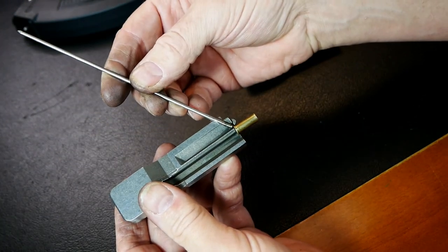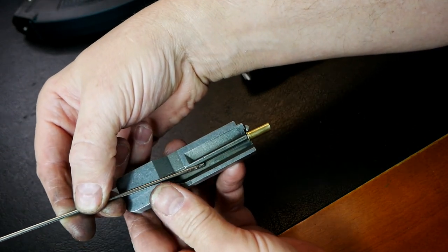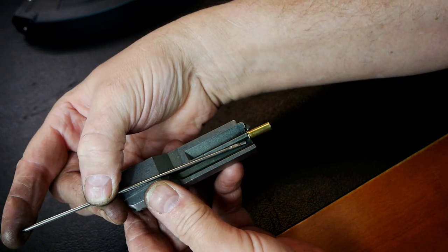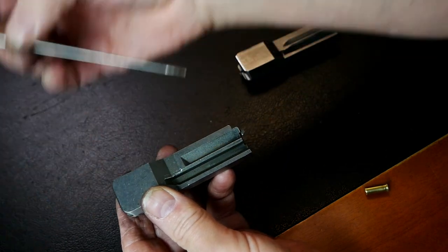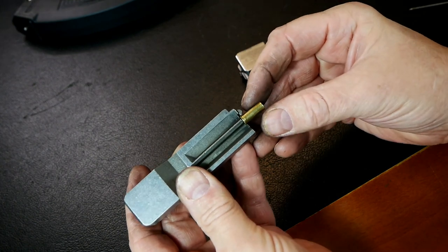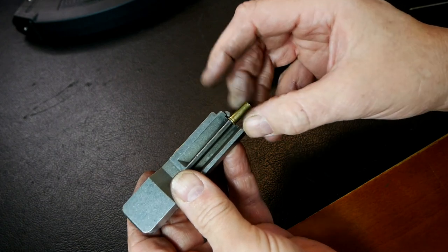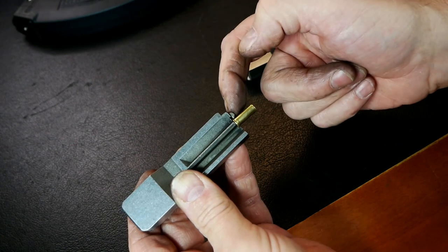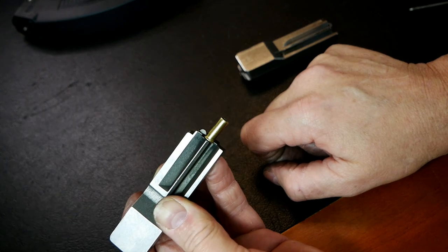So this is going to latch on your case relatively firmly, and then as the rifle bolt moves backwards, the ejector on the magazine is going to come along and engage the rim of your case right here and pop it off, okay? Only it's not going to just pop it off. This is happening fast with a tremendous amount of force, so it's going to unlatch, and the amount of force that that extractor or ejector can impart onto the casing is going to be determined by when that casing releases off of your extractor, okay?